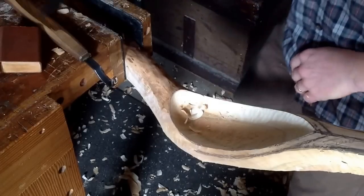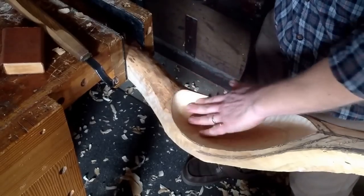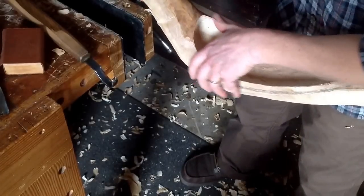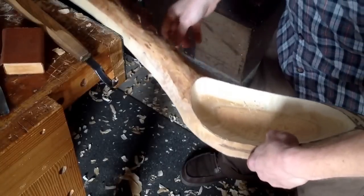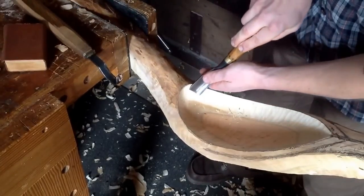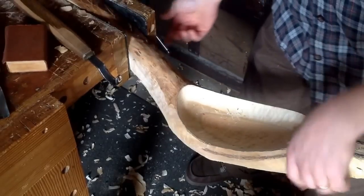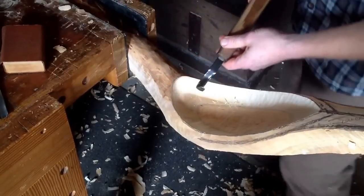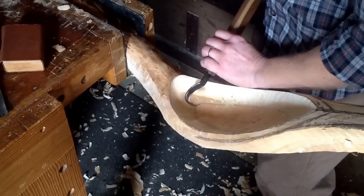all the way into the middle portion of the bowl, adjusting to the grain and so on. But when you get to areas like this deep undercut here, and I want it to be much deeper, actually, I want that undercut to flow back into the chest area of the bird and be much deeper and more undercut. In order to do that, I have to switch out from a gouge. Now I could use a much deeper spoon gouge type of thing, but I really enjoy using the Twca Cam for this. So what it allows me to do is a number of different things.